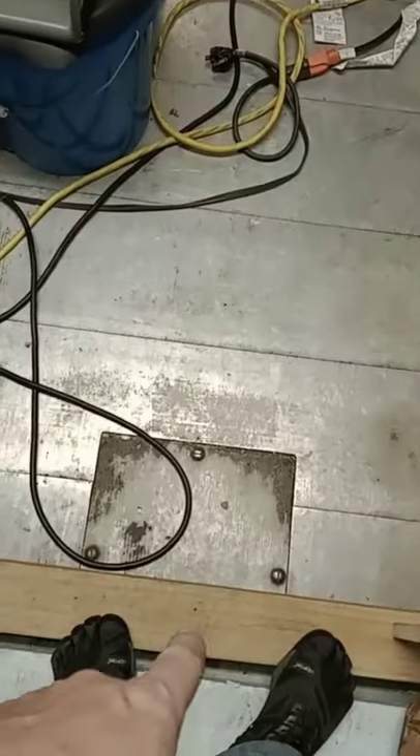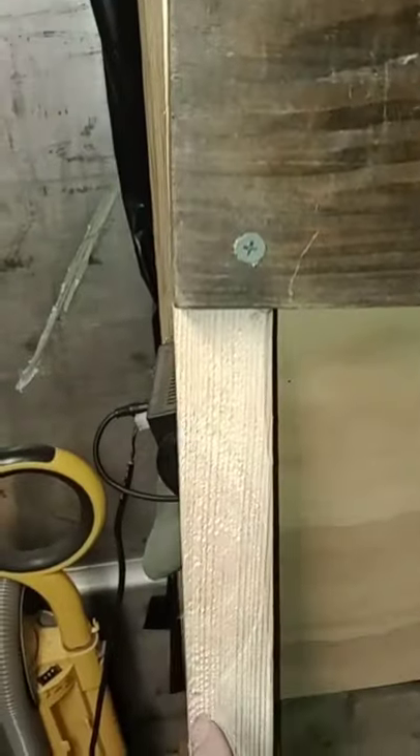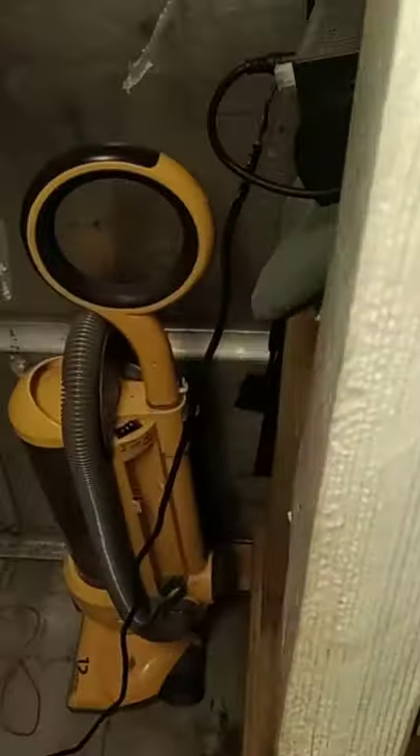We have a nice floor - I did keep to this so it's still removable. There's a screw underneath that 2x4. Once I get both sides boxed in and secured, there's a possibility I might have to trim just a tiny bit off of this or shift the entire thing to the right. My slider is going to have to stand back off of that - this is about a half inch off and that's a 2x4, so I can go two inches out from this. If not I'll just take a circular saw and lop that son of a right off.